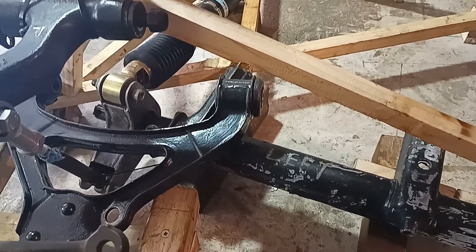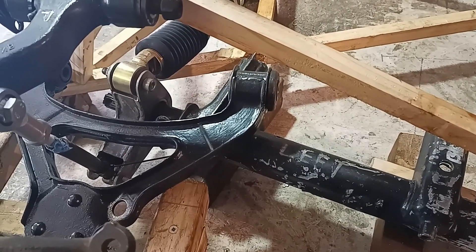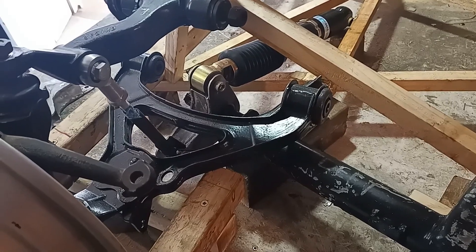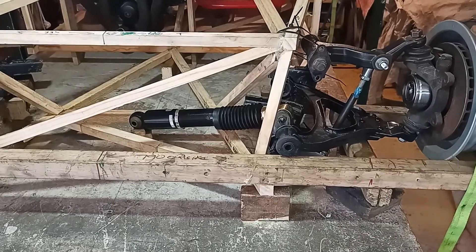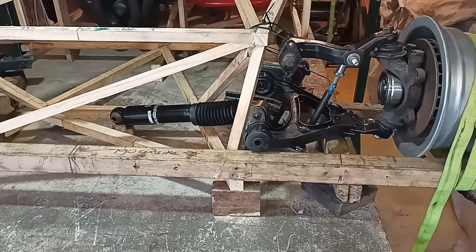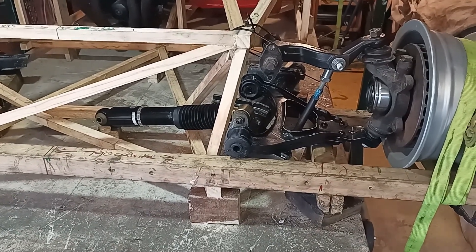Overall I've probably got about a four kilogram penalty per side compared to just a simple arrangement of coil springs or coilovers, albeit that I would have struggled to fit coilovers into the limited space. I hope to compensate for the extra weight because the weight is positioned very low in the car, and I've now got tremendous adjustability in the suspension, including a rising rate on the springs.